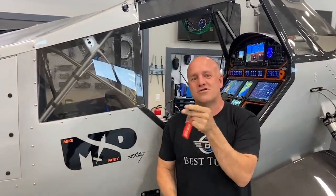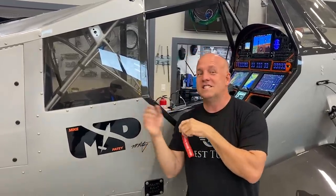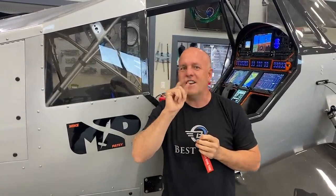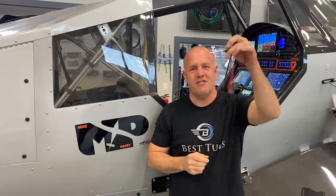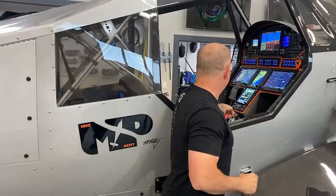Someone asked what happens if the gust lock pin that goes in the tail was lost or dropped in the weeds — you could be stranded. It's a great concern and it's something I addressed in the design. On the micro switches on the back side I put a pigtail wire — basically my own hot wire. The worst case scenario, the micro switch just contacts two grounds together to close a circuit. I took a wire with a pigtail that has the male end matching the female end of the wire hooked to the contactor — pull it off, plug the two together, and I've completely bypassed the micro switch without rewiring. It's my built-in hot wire system.